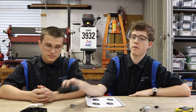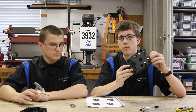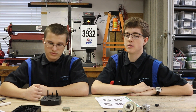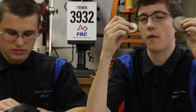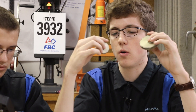If you want to pause the video now and assemble this, you can do so. That is the first step to assembling your gearbox. The next step is to assemble all the gears inside of the gearbox. What you're going to need are your pre-assembled shifter, one big gear, and one small gear. The number of teeth on these gears is going to depend on what gear ratio you ordered, so if yours don't look exactly like this, don't worry.